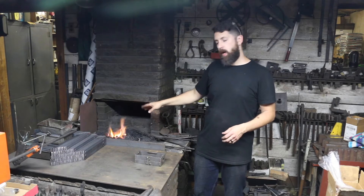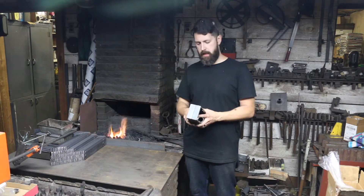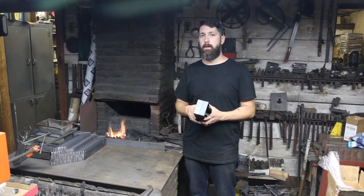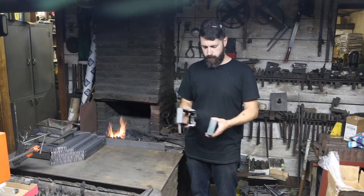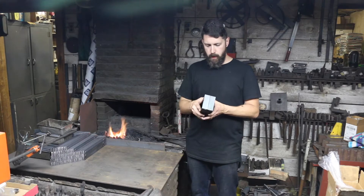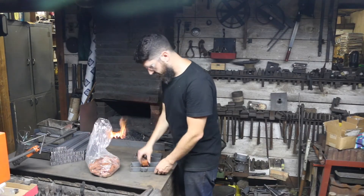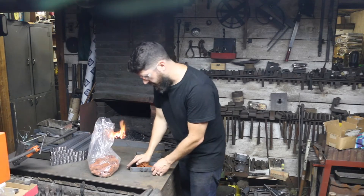While that's heating up — it'll take a little while — I'm going to pack my mold. I did a video before on brass casting and I haven't done this a ton, so by no means am I an expert, but I find that it's actually not too hard to do. I could probably get better and improve on the process but for what I've done so far it seemed to work alright. So I've got a two piece mold — you can buy these, I fabricated this one — and I'm using what's called Delft clay. I'll put some links in the description as to where you can find some of this stuff.